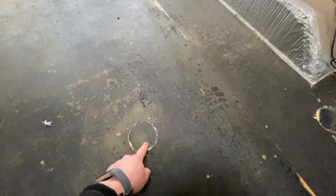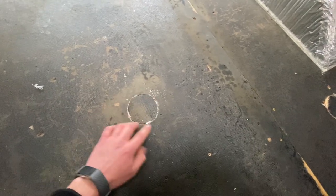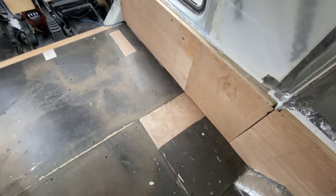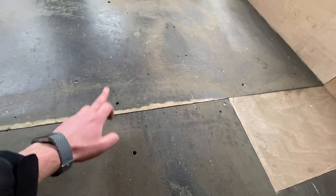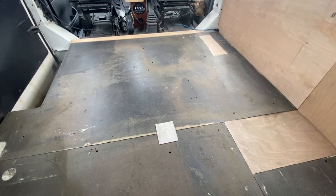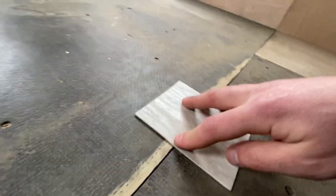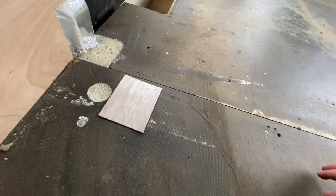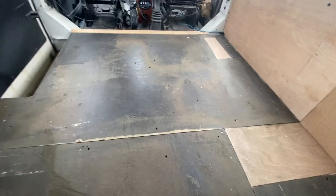I had to put these discs in here where the anchor points used to be, and we've got this ridge around the edge — a bit of a sharp edge which may damage our vinyl, so we need to fill this and sand it smooth. We've also got some holes that need to be filled, a couple of patches where the floor was damaged, and another one at the back where the gas locker was leaking. These boards don't quite line up so we've got a sharp edge that needs to be sorted. If we laid the vinyl directly on top as it is, over time this sharp edge may wear through the vinyl. Also, if you've got holes in the floor and someone came in with a high heel, that's going to come straight through.